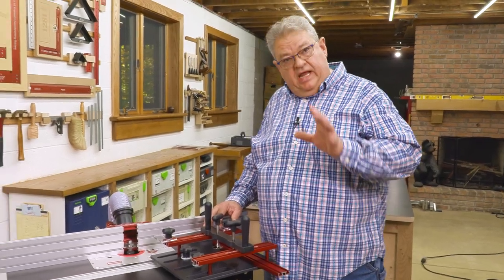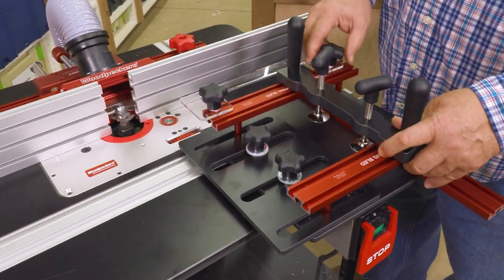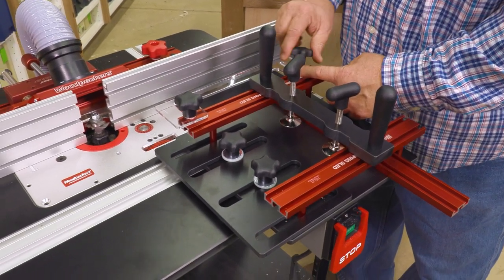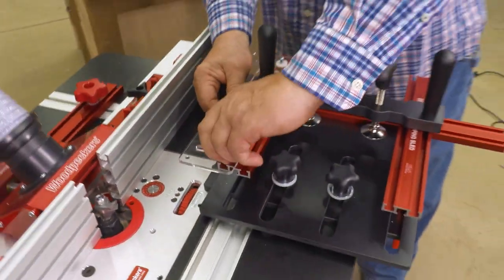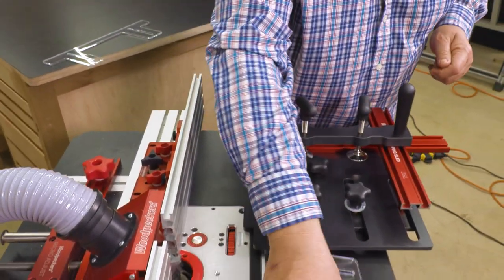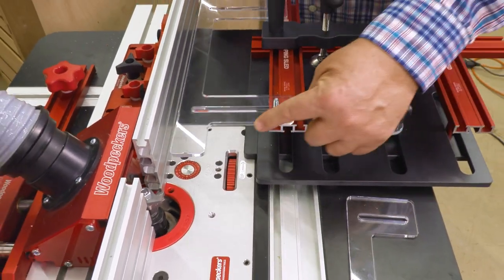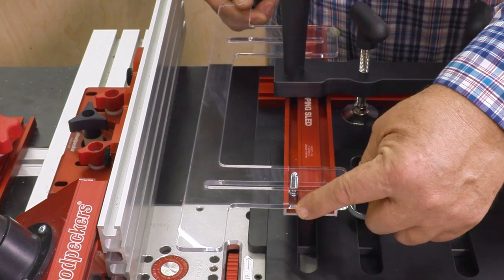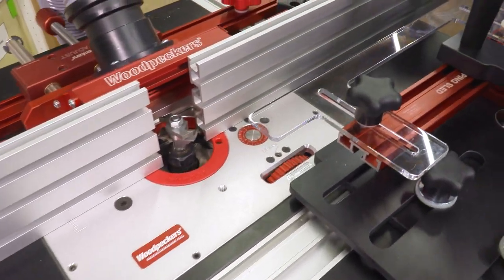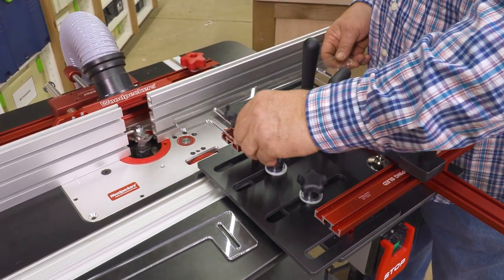We have one option that you can add to your coping sled. If you're doing deeper things like maybe some entry doors or possibly some long tenons, you may want more cutting depth. This is the standard guide - we can take that off. This other one has a much, much greater range of motion, so you can get some really deep tenons with that. The other thing we did with this is make it a bit longer. This longer guide lets you get on the outfeed side quicker, giving you better support. It works nicely with shorter fences and gives you a much greater depth range.